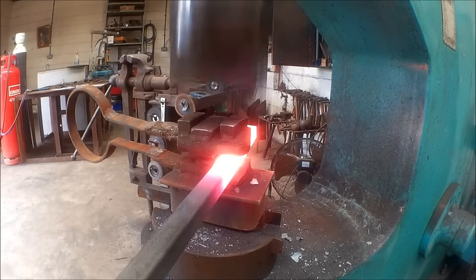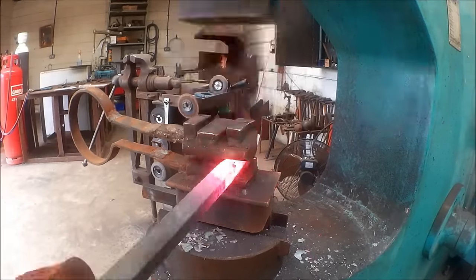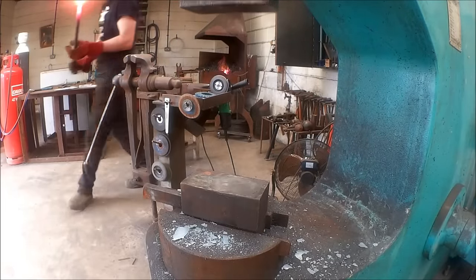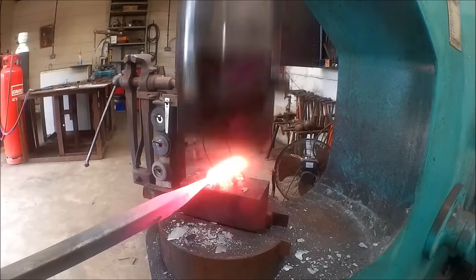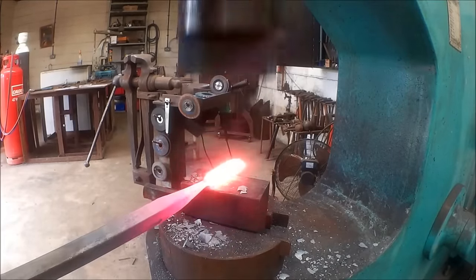So like forging a normal taper, you would start square, then knock the corners off to become octagonal, and continue to knock the corners until it's round. The section that I've left on the end of that stem I'm now going to flatten on its corners until it's the same thickness as the stem itself. This creates like a flattened hexagon with tapering sides.